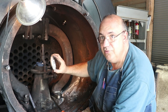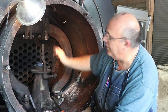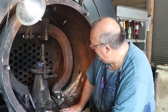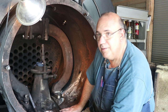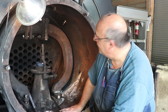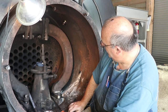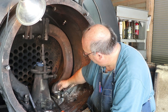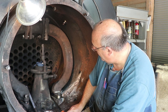And I'm going to make a new steam pipe ring, and before we do that, I'll come in here. We'll set everything back up once everything is brazed in place at the very end, and I will make sure that that's the correct measurement. We can make that thickness whatever it needs to be. That's another little adjustment that I have up my sleeve for down the road. But again, I just wanted to give you a quick update of where we are. I scribed on here roughly where the steam pipe's gonna fit in there, and I pulled it out. It's right on center, so I'm good there.